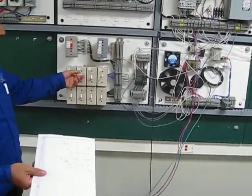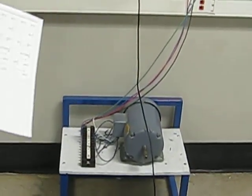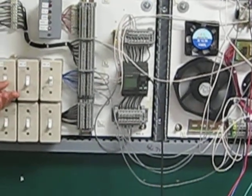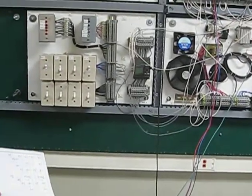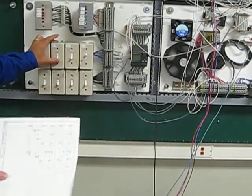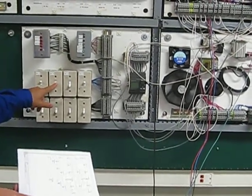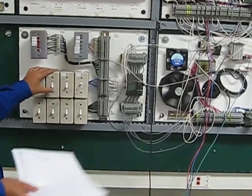When the pressure comes back, pump number two should kick in because that's how we alternate these pumps. The pressure comes back and pump number two is on. If the pressure goes down, pump number two goes off, and next time the pressure switch comes on, pump number one should go on and alternate — as you can see. We have to let the timer time out — a few seconds — and then pump number one or two should come on when the pressure switch activates.